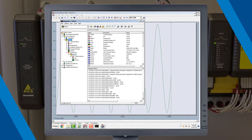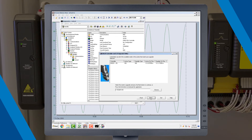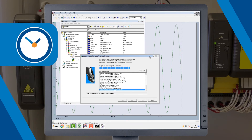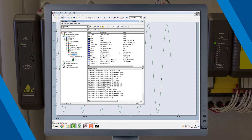Finally, we will return to Delta V to verify the health of this new MQ redundant pair. Check the properties of the standby to verify it is now an MQ controller. Check the firmware of the new standby controller to see if it needs to be flashed. This standby controller's firmware is at Delta V version 12.3.1, and we need it to match version 13.3 of the active controller. Flash the standby to the current revision using the controller upgrade utility. Wait for P-Avail to become yes after flashing — this indicates that the new MQ controller pair is redundant and healthy.